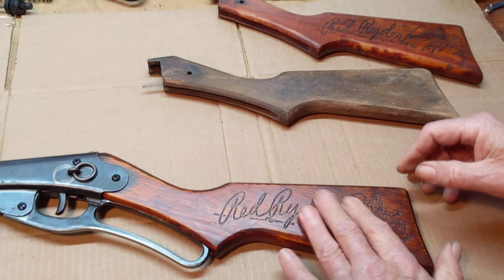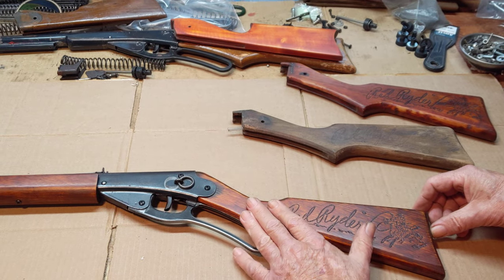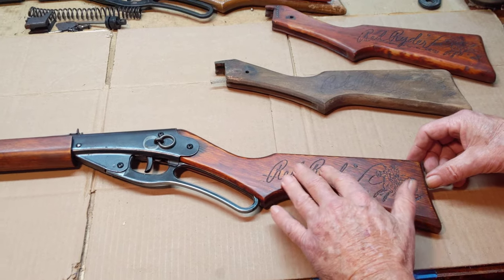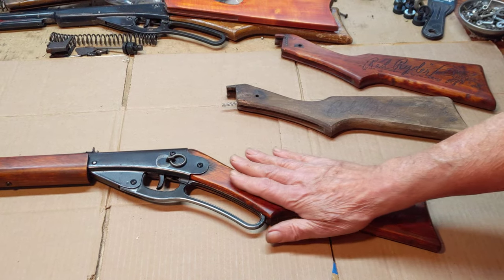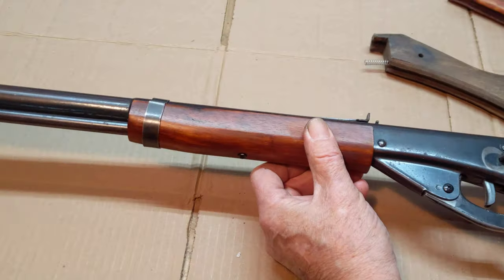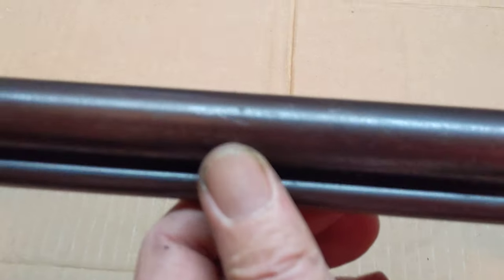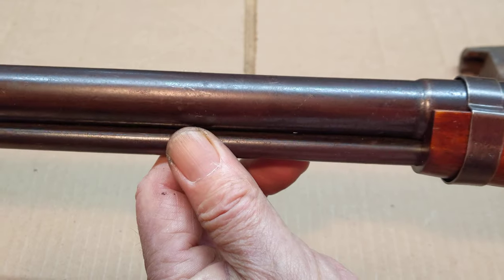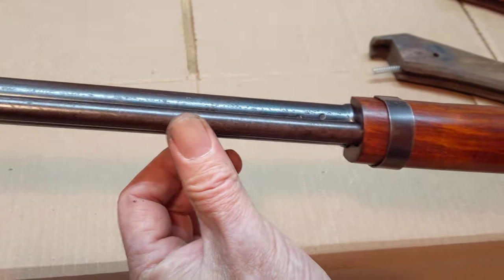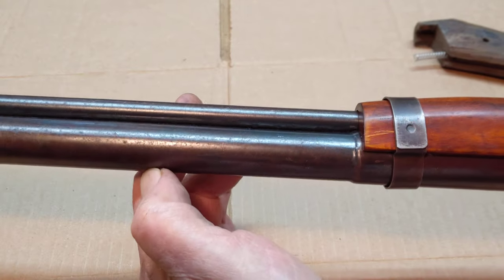But this particular stock set had not. By the time I get done with it, I strip the varnish, take it up to about 320 on sanding, then dye it, and then apply Danish oil to it and back-sand. It's got a good slick feel, it's got a good tone to the wood. It matches the patina on this particular gun pretty well. I think it looks appropriate. Let's roll down here to the muzzle and take a look — you can see that slightly plumish, brownish look. Kind of hard to see under the LED lights and the incandescence, but it has a patina, as they call it.